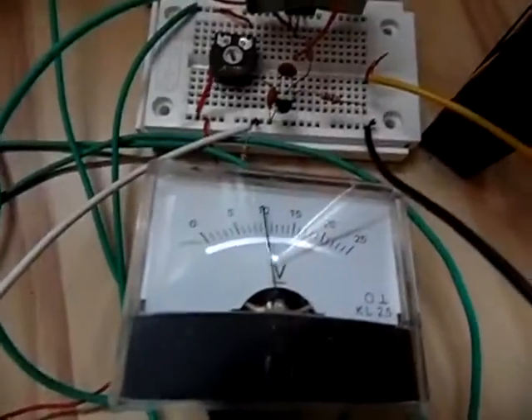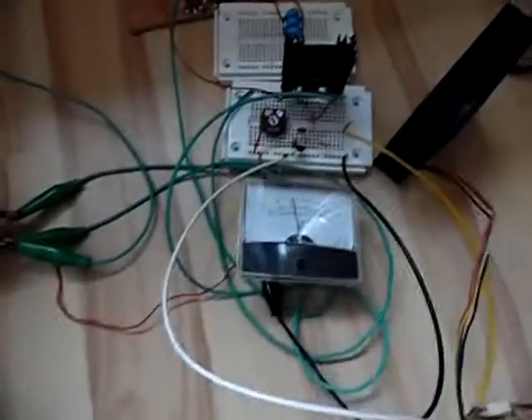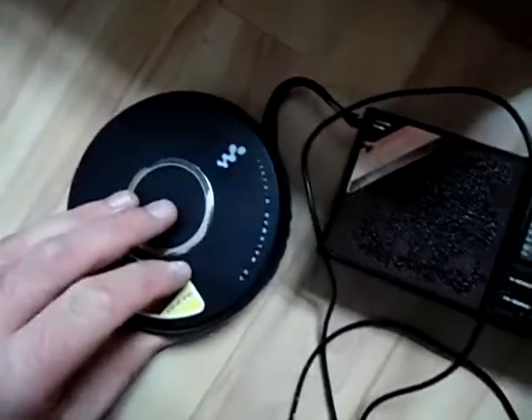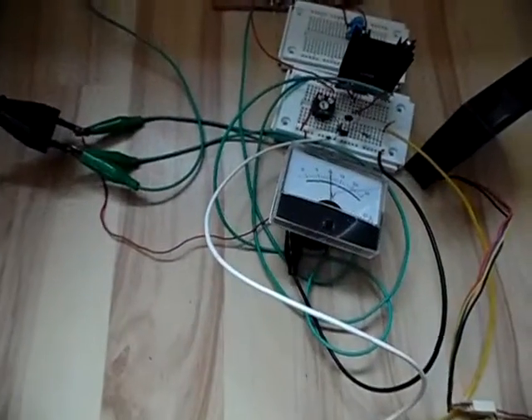Now I'm consuming - okay, now I have pretty much five watts of RF power on this circuit. I have to increase the volume - that's not really a big deal, let's go up to like 90 or so. I can already hear the modulation from the circuit board because the components are already starting to demodulate the signal as if they were a receiver.